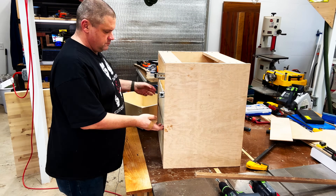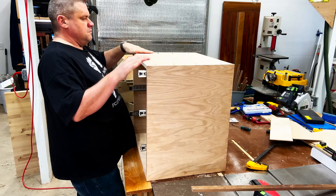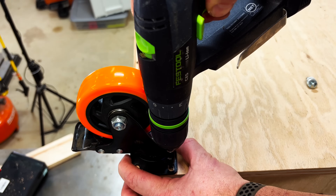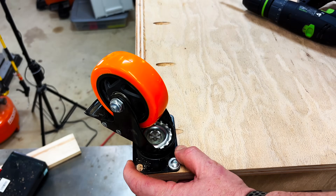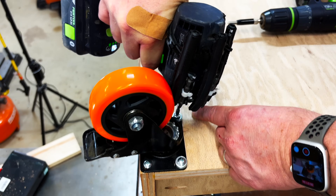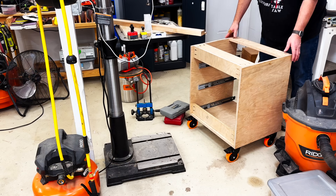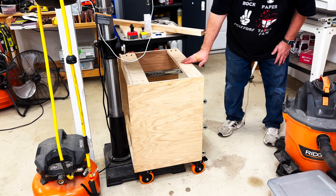Either way it all worked out. Now it's time to remove the drawers. With the drawers removed we can flip the cabinet over to work on attaching the wheels. I'm penciling in where those screws will need to land on the bottom of the cabinet. Once those markings are made I'll pre-drill a hole at each spot. Then it's just a matter of mounting those wheels to the bottom with screws and washers. I'll leave a link in the description for these wheels — they're some of the highest quality larger wheels I've seen at this price point.